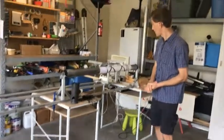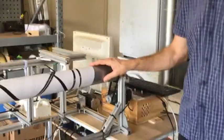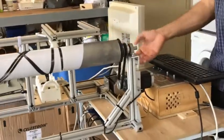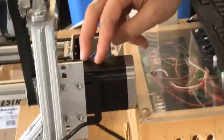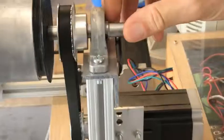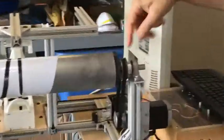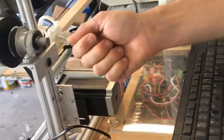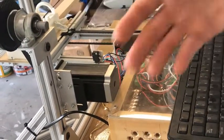So, let's talk about this machine. Here we have the mandrel — the mandrel that we wind the carbon fiber onto. This mandrel is turned by a stepper motor, a NEMA 23. Around this side here we have a little timing belt gear, and we have another one on this axle here, which drives the mandrel. The mandrel has a pillow block bearing at each end, which helps to ensure that it runs smoothly. The computer sends the stepper motor a pulse, and every time it receives a pulse it turns a very small amount — send lots of pulses and it turns a corresponding amount.